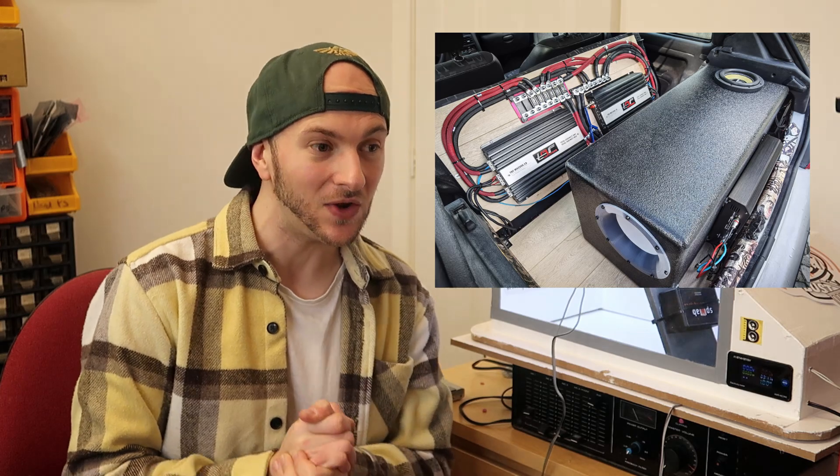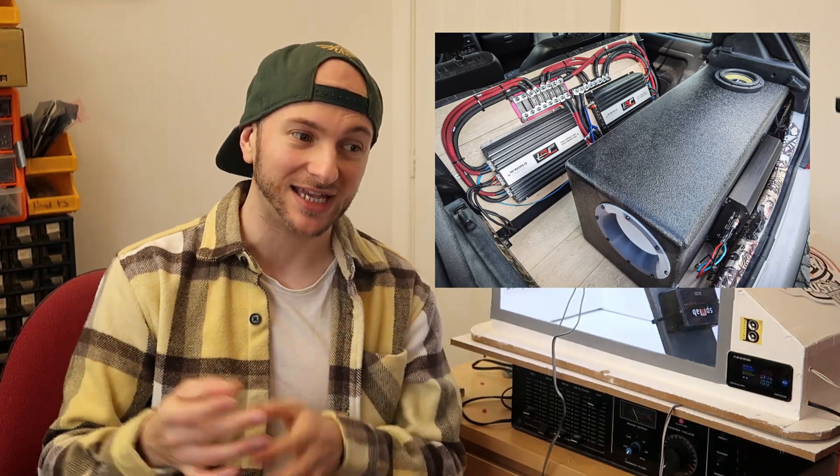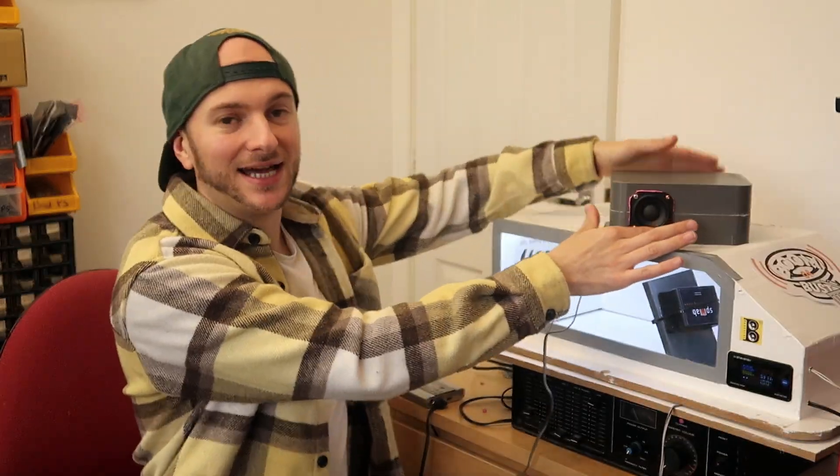With a single six and a half doing a 142 dB at 30 Hertz - that is absolutely insane. I can't get my head around how ridiculous that is. At 30 Hertz, a 142 from a single six and a half inch woofer. Looking at the picture, the box is pretty big, so I imagine you could technically squeeze a couple of 12s in that same volume space. I'm curious to see what this looks like on the Dayton DATS V3 via an impedance sweep.